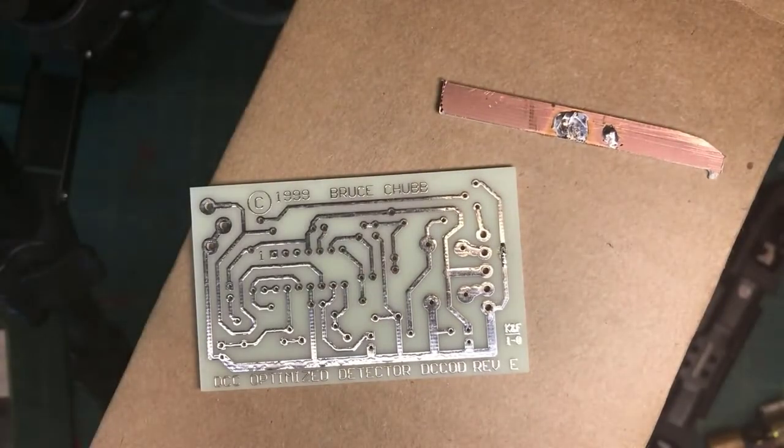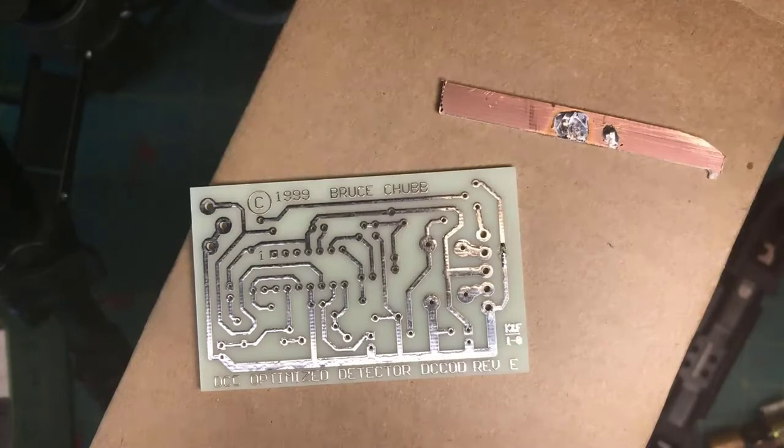That's the way you would approach it, putting the super glue on top. Now, I've got to make sure that the connection is actually really good electrically before I put super glue on it. You might fire up your voltmeter and check for good continuity, low resistance for that connection before you seal it with a dot of glue, whether hot glue, super glue, your mother's old glue from 1952.